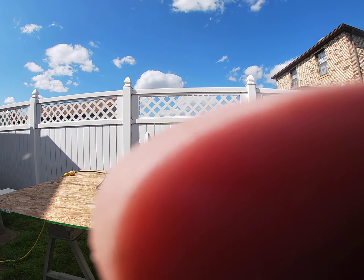I'm going to set this thing down for a second. The boards I have underneath are something I don't want to cut into because I'm going to use them for the actual steps to get up into the loft. So I'm going to put this railing baluster — just something extra I have — under here to prop it up so I don't cut through. I'll pick this up and slide it underneath. That's going to support the material and keep it from crashing down. When I'm done with my cut, this is going to fall down just a little bit, but not enough to be an unsafe situation — that's why we're doing this.